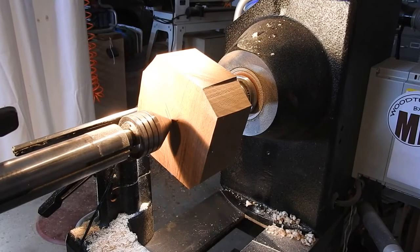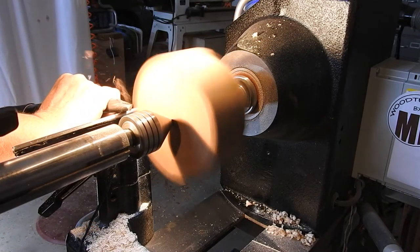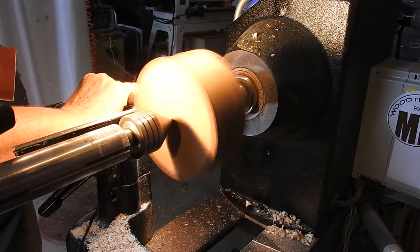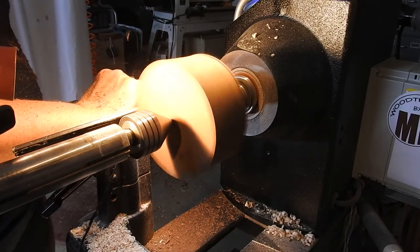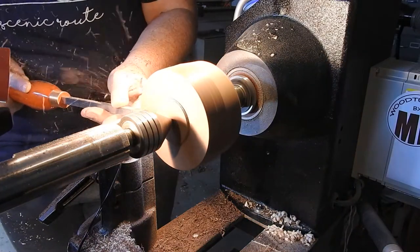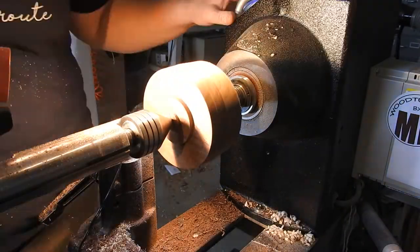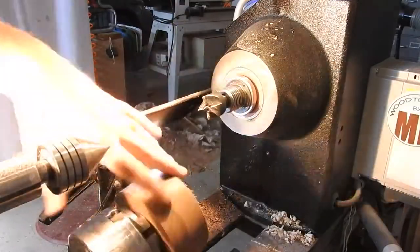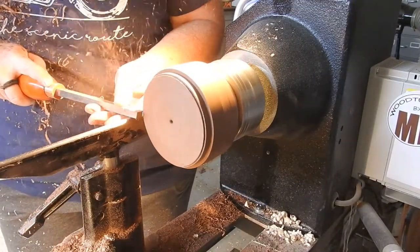Alright, round two — where I am going to make the lid. This is made from walnut, yes, the same walnut from big brother's tree. Just using the old five-eighths bowl gouge to round it out. Here I'm using the Easywood Tools mid-sized rougher to make a tenon for the chuck, and then I'm just saddling up the wood to the chuck and getting it to the approximate diameter of the lid on the bowl.